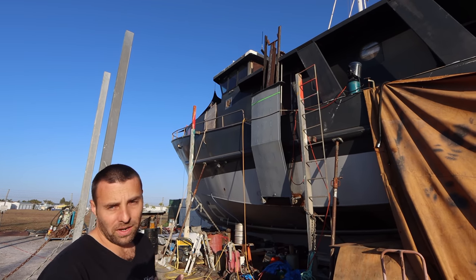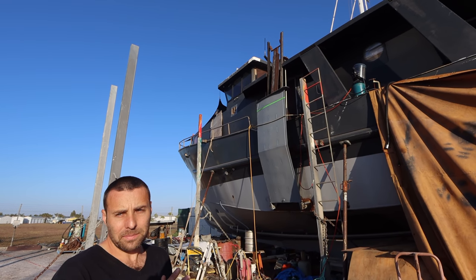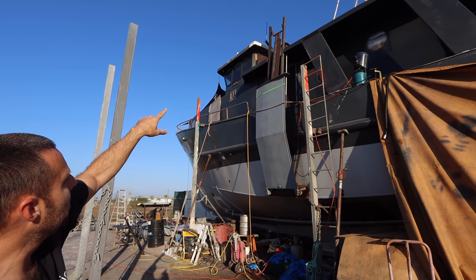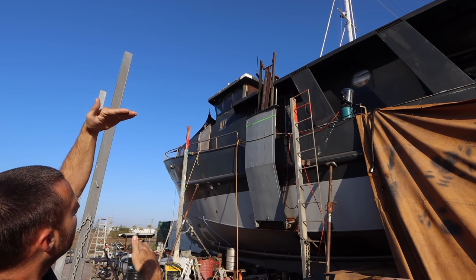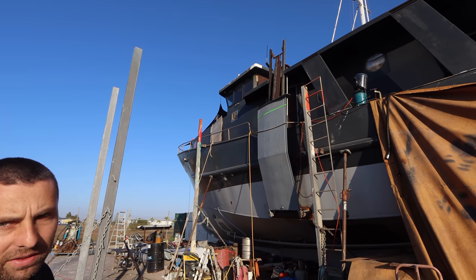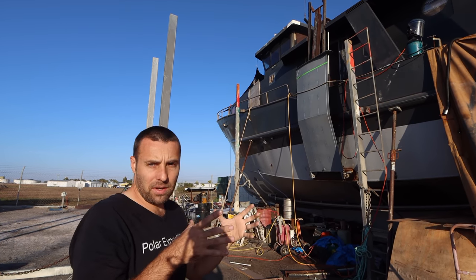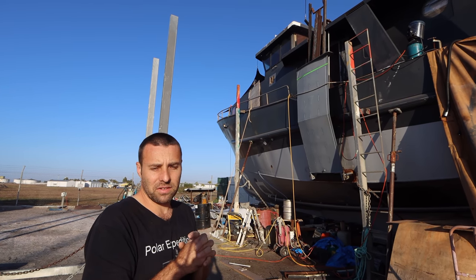The wheelhouse roof, however, is bloody strong. So that's 6mm steel. And you're on a corner, which, you know, you've got all that extra. So if you look up where you can sort of see where the winch is mounted, just behind that white painted bit there, you've got the two angles of a vertical, plus you've got the 6mm horizontal. So you've got a huge amount of strength in that one corner, and you've got the 12mm doubler that the winch is welded onto. So it's a massive amount of strength, and crossing a metre or so over to the sliders is an absolute non-issue.